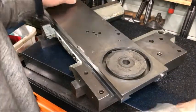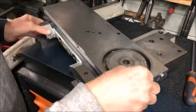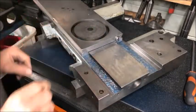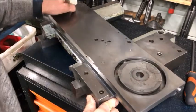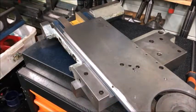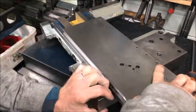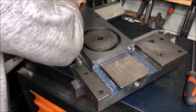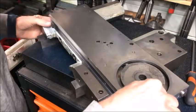And then you can see there's no rock. I measured the play afterwards, and then of course, revealing the blue. After bluing up, it all is smooth and nice — I had to correct it a little bit to get it that way. So there is no play there either. This is now at this stage OK to proceed, then with the screw and the assembly, and also of course then with testing.